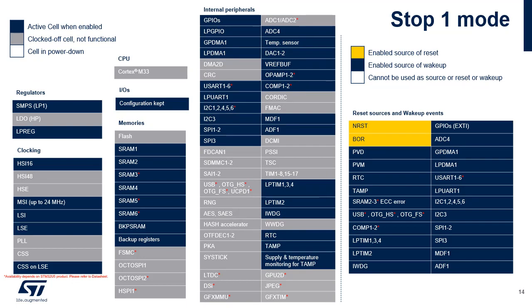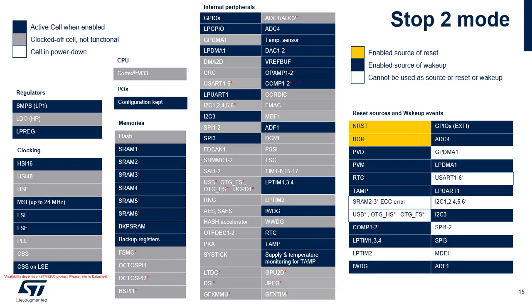Stop 1 mode is very similar to Stop 0 except that the power figures are much lower as the main regulator is stopped and replaced by the low-power regulator. In Stop 2 mode, most of the V-Core domain is put into a lower leakage mode. All clocks in the core domain are stopped; the PLL, MSIS, MSIK, HSI16 and HSE oscillators are disabled. Some peripherals with LP-BAM capability can switch on HSI16, MSIS or MSIK for transferring data. All SRAMs and register contents are preserved but the SRAMs can be totally or partially switched off to further reduce consumption. The BOR is always available in Stop 2 mode.